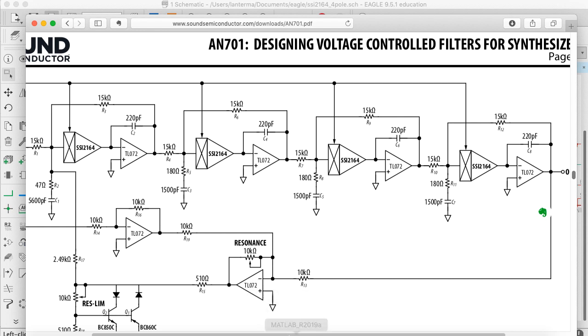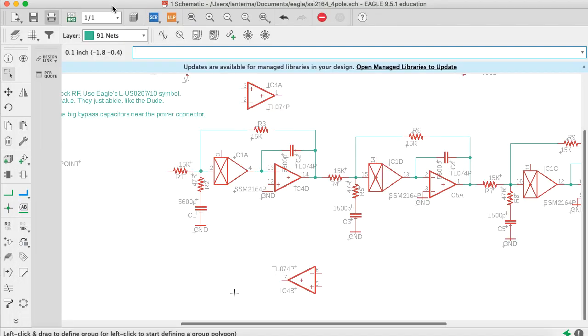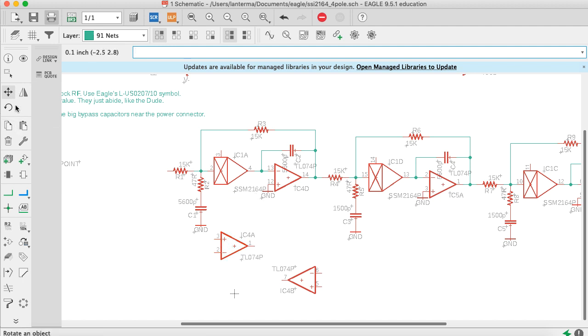And then I'll probably do that without making all of you watch me do that. And the input, so that's in the upper left. So for that, I'll use 4A. Let's go get that. So move 4A. Here it is. The way they like to set that up, and the way I like to set up too, is the positive is downward, negative is upward. Okay, so I'm going to stop the video here and wire up the rest of this, and then we'll work on the PCB some more.